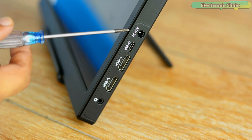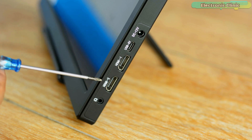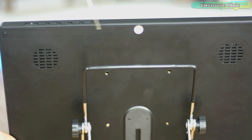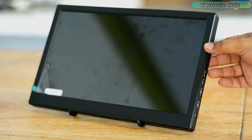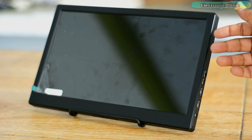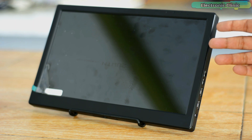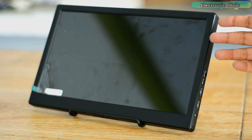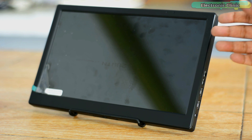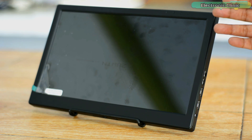On the right side we have a DC 12-volt power jack, USB 5-volt input or 5-volt output, HDMI 1, HDMI 2, and an earphone jack. Power consumption is only 10 watts. It has two speakers on the back. Display color is 262K, interface type is digital, response time is only 5 milliseconds, working temperature is -20°C to +80°C, and working voltage is 5 to 12 volts DC. It supports 50Hz and 60Hz — note it does not support 120Hz or 144Hz. It supports multi-function OSD operations and multiple OSD languages.